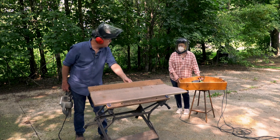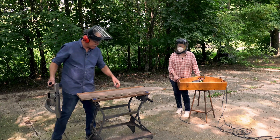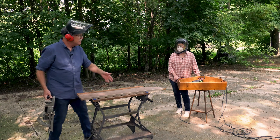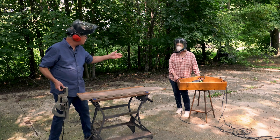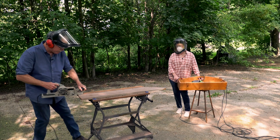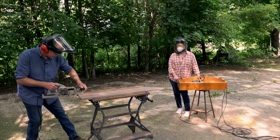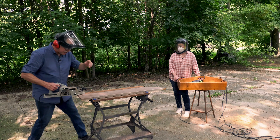Now Susie, that's a perfect looking board. I'm using a handheld planer because I love my wife — this is going to save you a ton of sanding time. You could sand straight to this rough sawn board, but it'd take forever. So I'll get this planed down both sides, and then it's on to you for a sanding workshop.